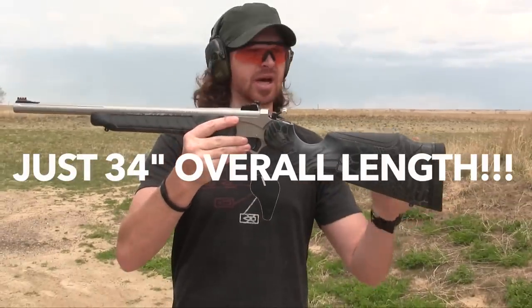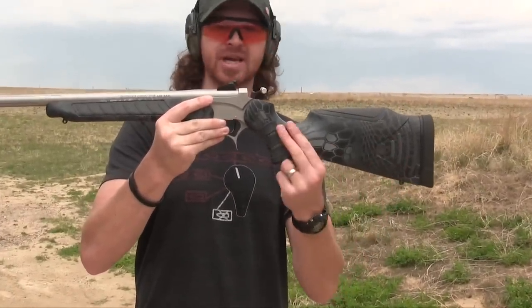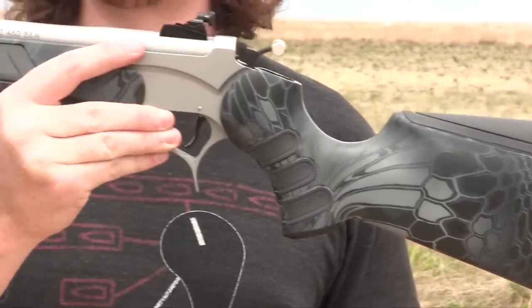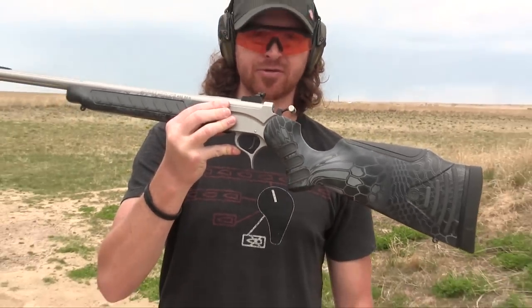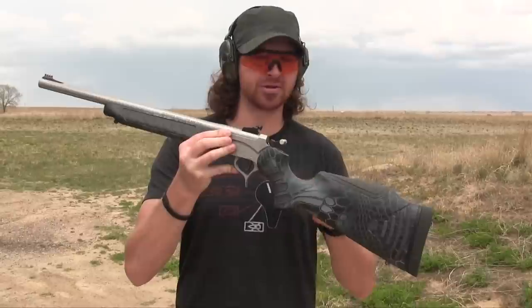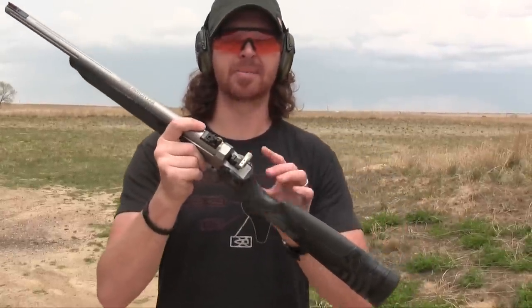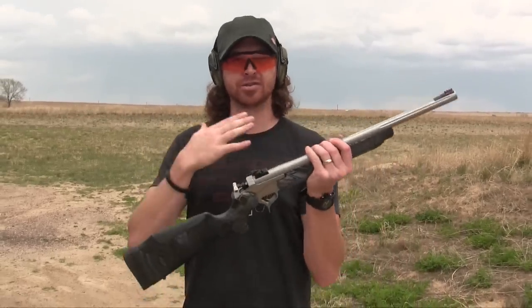This is a Pro Hunter stock set, so it's got the recoil reduction system built into it. This is my Kryptek Typhon stock that Brett from Reaper Innovative Precision dipped for me. I put it on this stainless setup. This is an original Thompson Center New Hampshire frame that I did a trigger job on — the trigger's breaking under three and a half pounds, really crisp. It's got a hammer extension called a triple lock, which we get from Mike Bell MTCs. We sell all of this stuff, including the trigger jobs, in house.